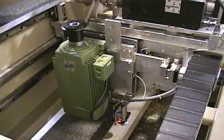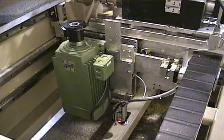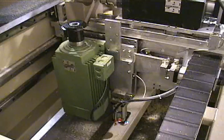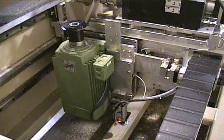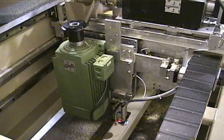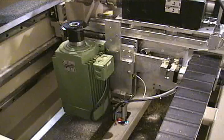The coping spindle will turn up to 9,000 RPM. It is 9 horsepower and will handle most any coping tool. Tools may be stacked to accommodate more than one profile. This machine is set up to use digital hand wheels to control the height as well as the depth of the cut. The controls for these, as well as other settings on the machine, may also be CNC controlled.